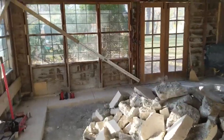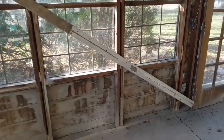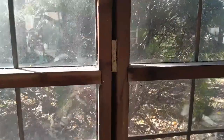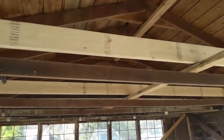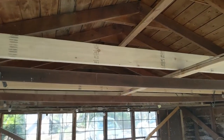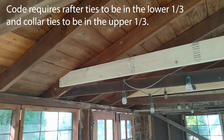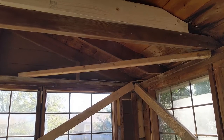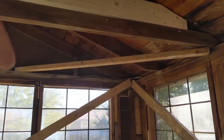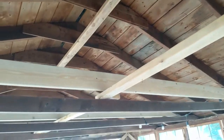But before we do that, I had to put some bracing in. That included bracing in between the studs and up here, replacing the wimpy 2x4s with 2x6s and raising them up — more for aesthetics. It's within the bottom one-third of the roof, so it's still structurally fine. Corner bracing right here to keep it square. This here is the gable end, and we put in a 2x tie basically all the way to the other gable end.